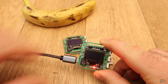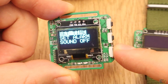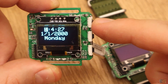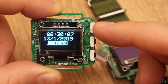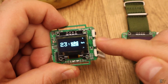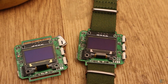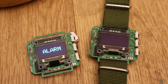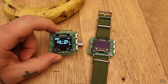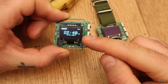To recharge it, just plug the USB connector. Now long press the middle button and we get into the menu. Here we can set the time, set an alarm, turn off the beeps for the buzzer, show the watch logo, enter a stopwatch counter or go back. The set time option is very basic — enter and select the time, the date and the day of the week and it will get saved to the real-time clock chip. We can also set an alarm — choose the hour and the minute and it will set an alarm. Now we have a small icon of a clock in the corner. Even if the watch is in sleep mode, when the alarm time is reached the interruption will wake up the clock and ring the alarm. After the alarm is set, long pressing the top button on the main menu will enable or disable the alarm and the clock icon will appear or disappear.